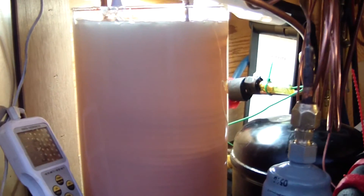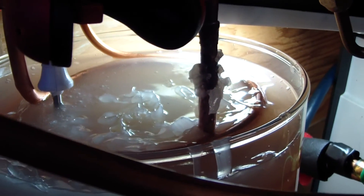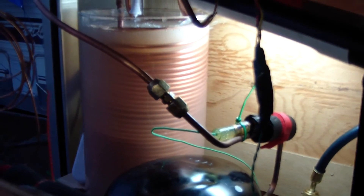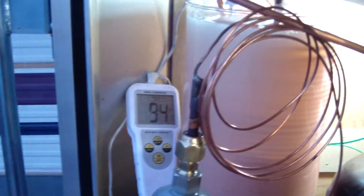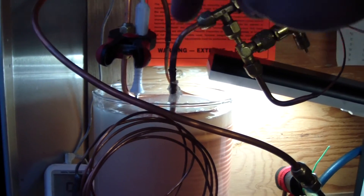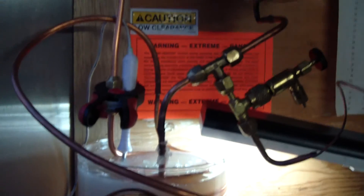The paraffin is getting milky and semi-solid now — you can see the goopy stuff on top from probing around. It's at about 94°F, and I expect it to hold over for two or more hours, maybe up to four. For the rest of the evening I'll keep an eye on the wax temperature. As the wax cools, thermosyphon activity will decrease since there'll be less temperature difference between the air across the condensing coil and the evaporator at the bottom.